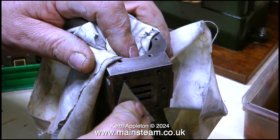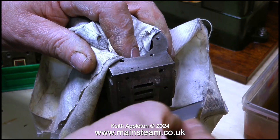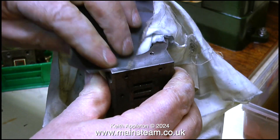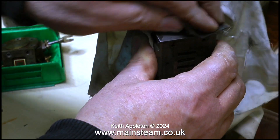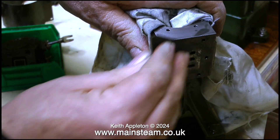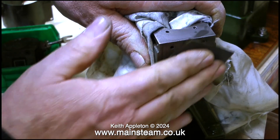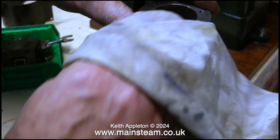In this clip I'm using a very sharp blade to scrape off any residue from the mating surfaces, as well as the last of the varnish from the top of the steam chest and the cylinder casting. Now I'm scraping the port face, and then I'm using some 400 grit wet-and-dry sandpaper to shine up the top of the cylinder block. There is a cloth pushed into the cylinder bore to stop any grit from entering and causing damage — though the first steam that contacts the cylinder condenses to water, and the mixture of water and steam will clean the cylinder bore very effectively. Any particles of grit or debris will be blown out of the drain cocks.